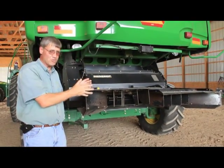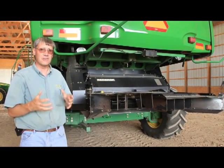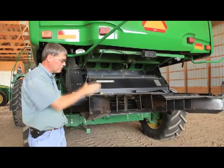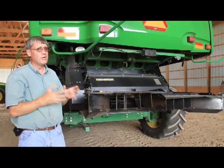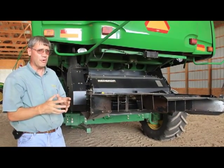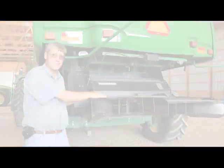If it's going to take a lot of time with wrenches to make these changes, the chances are some operators probably aren't going to take that time. Adjusting the tailboard and adjusting the direction of residue flow into the chopper are two really important points to spread residue better with a chopper.